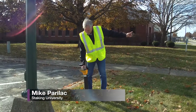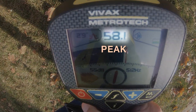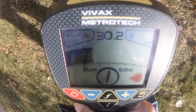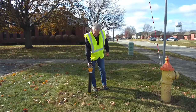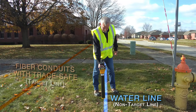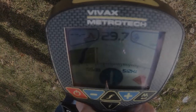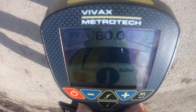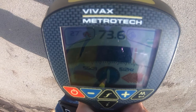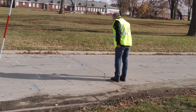We're going to locate to my left, paying attention to the peak number. We have a second peak right here, and this location is over the water main. So peak and null disagree, and the amount that they disagree is the distance between my two toes.